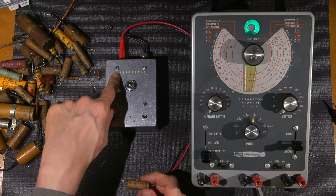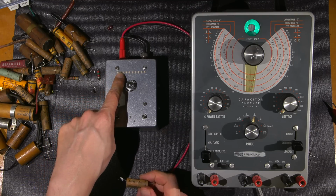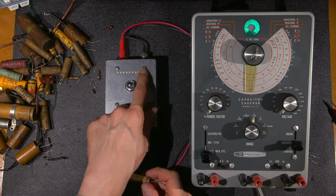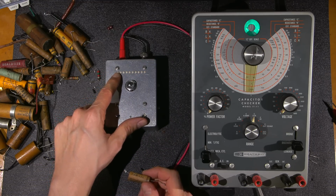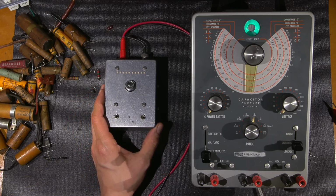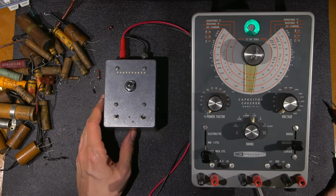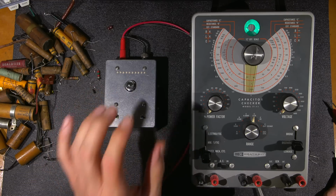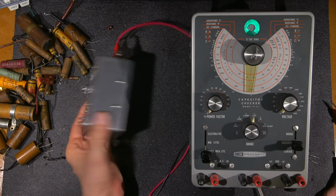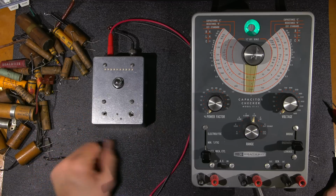The first light's about 1 megohm to a short. The second one will go to about 10 and a bit, and then the third one is going up. And this here is just about 1 gigohm, and then when the scale flips again to the yellow, it's a gigohm, and that's all the way to 40 billion ohms this tests. So if there's any leakage through moisture ingression in any of your capacitors or anything like that, this detects it. That's the reason I had to build this, is to fix that transmitter. And that transmitter, as I say, no problems.